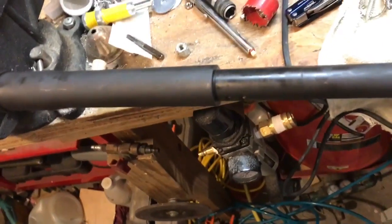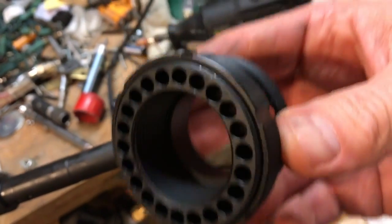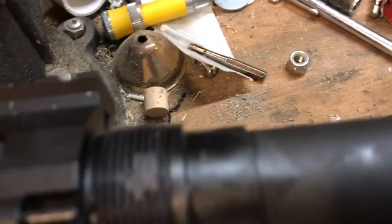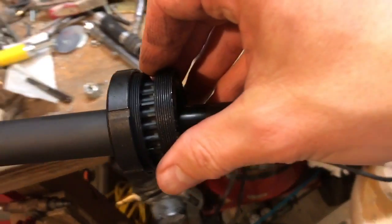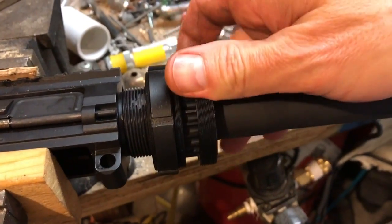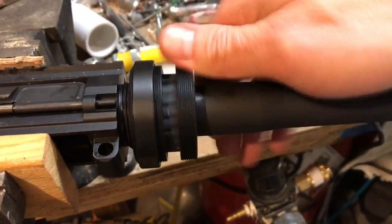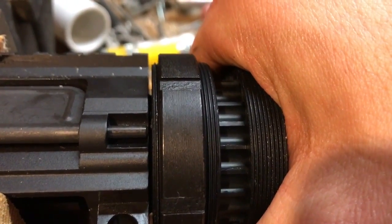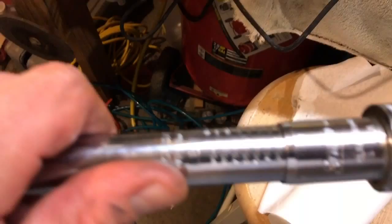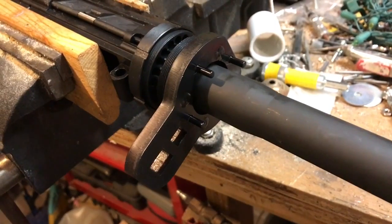I polished my feed ramps. Now I'm taking the nut that came from Monstrum — I've already applied a little graphite grease to help with threading — and I'm going to thread it on. This is probably the toughest part of the whole install. There's a little spacing because it's grabbing the barrel and starting to tighten against the receiver. I have my torque wrench set at 30 foot-pounds and my barrel nut wrench ready.